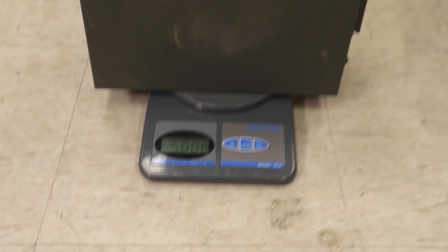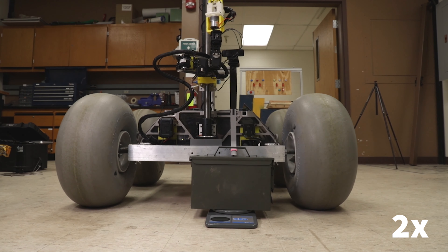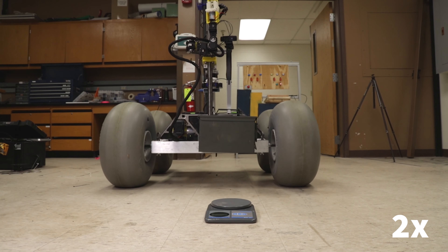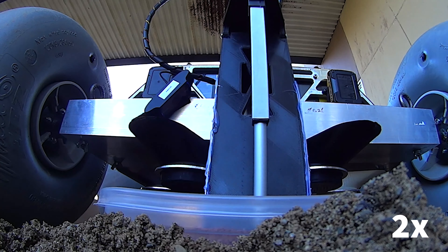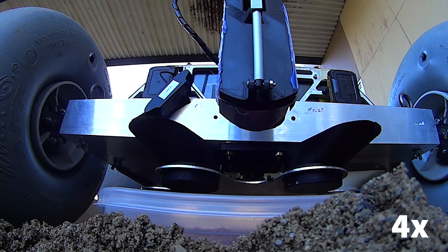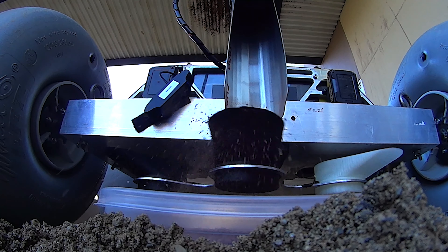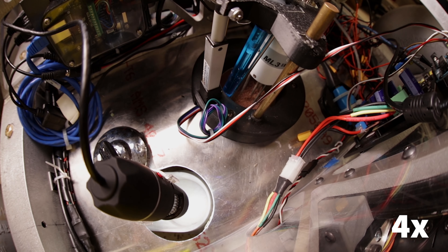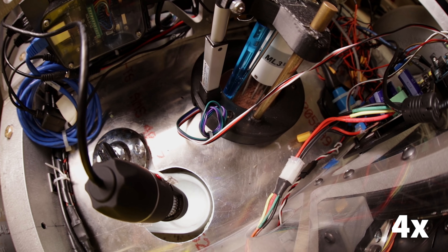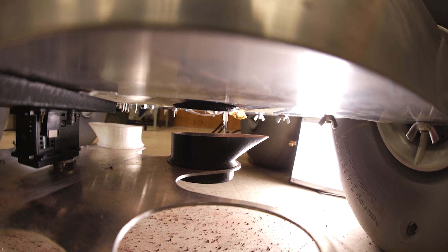For the equipment servicing mission, we have constructed a 1 meter lift and high precision arm. Controlled by a joystick and inverse kinematics, this arm provides operators with 6 degrees of freedom. This arm's end effector is a lead screw actuated 4 bar gripper. The end effector complies around cylindrical objects, and its tips are coated in polyurethane to increase gripping force. In addition, a hook is attached to the base of the arm for lifting objects up to 5 kilograms.